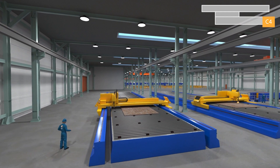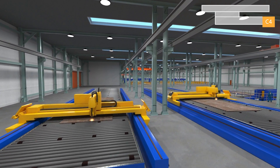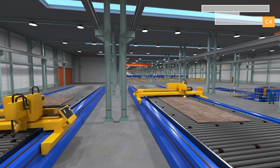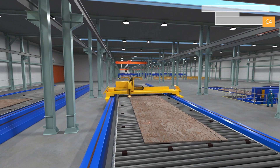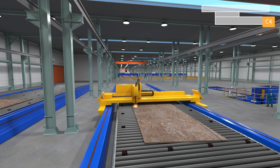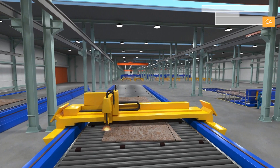In our new Hall C, the plates are prepared, welded, grinded, milled and checked until they've become cones and cans. Here at the start of the process, the plates for the cones are pre-cut in final shapes. Using these smaller shapes means we make the best possible use of plates, have less cutting loss and we can eventually roll the cone in one single move.